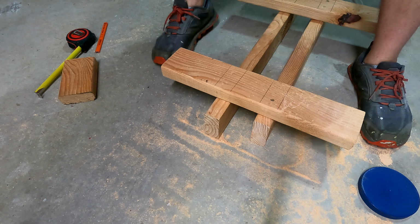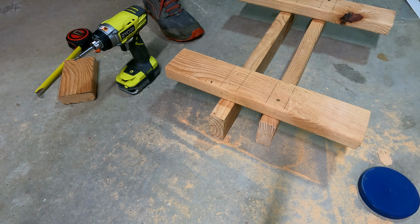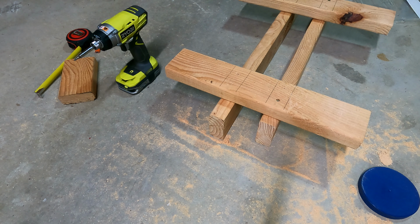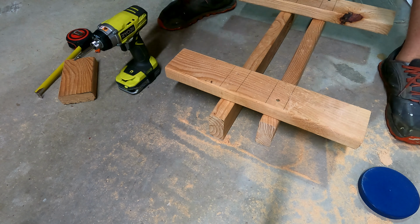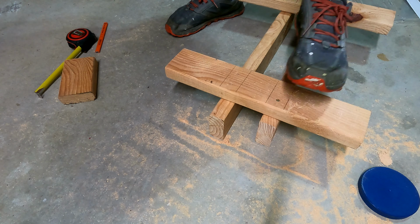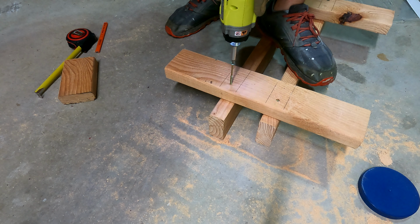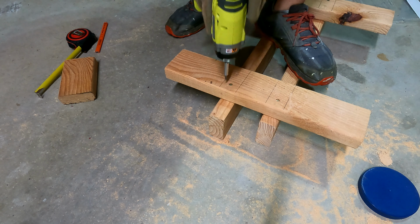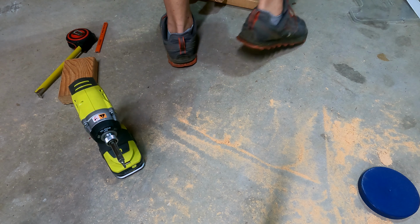And honestly, it worked out quite well. And it is working out well. It's currently holding my bike as I plan on going riding tomorrow. So yeah, those baseboards you see there, those are 18 inches long. The ones on top are 25 inches. Again, I did that because I have 29ers and they are 2.4. If anyone out there is watching this and you want to build something like this, just kind of estimate. If you have 27.5s, you may not need it that long. People out there may even think that 25 inches was overkill, or 18 was overkill, and that you could have probably gone with a little bit less. But I just thought that this would be the best way to go about it.